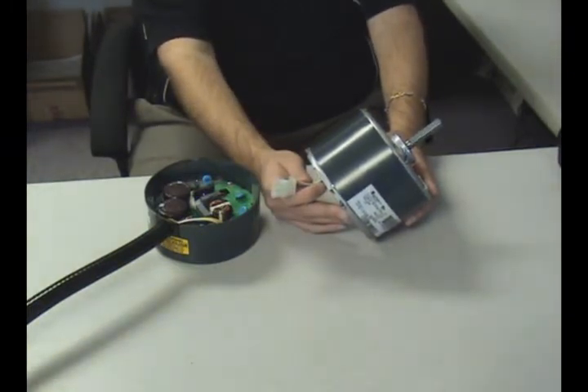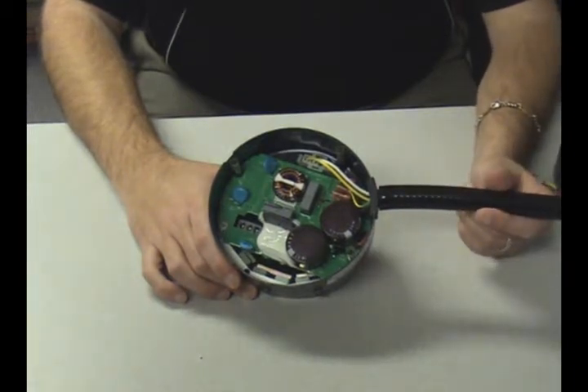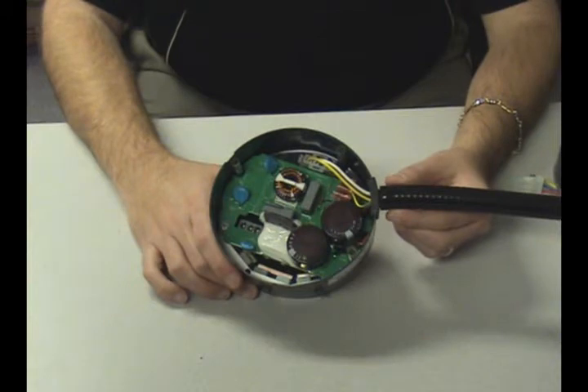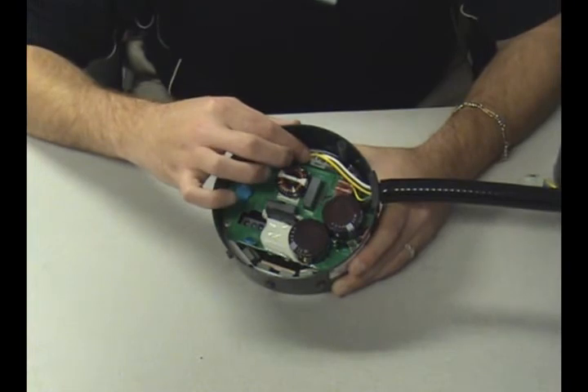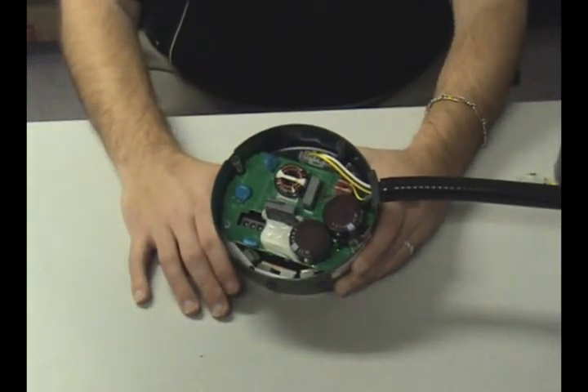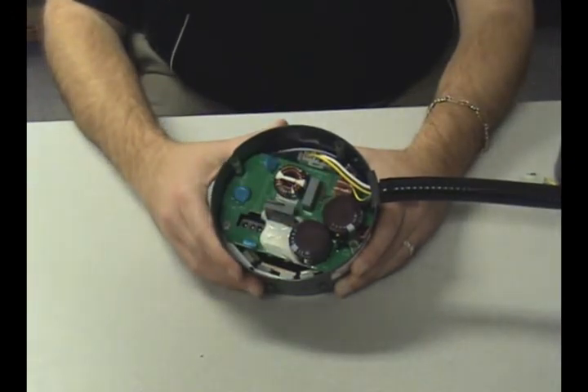If you need to do a winding section test with your VZ7 diagnostic tool, you will plug the VZ7 small harness into this connector. The electronics module, however, has connectors that are quite different than any other ECM motor. The unit is more waterproof than inside units and probably has a conduit and plastic conduit connector going into the side of the motor. The lower voltage signal lines are connected through a polarized four-pin connector in the electronics section. The power connections, 240 volts, are provided by three male quarter-inch quick disconnect tabs built into the upper circuit board in the module.